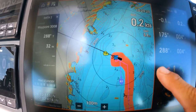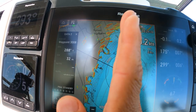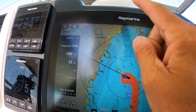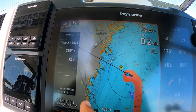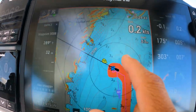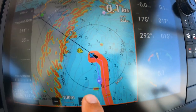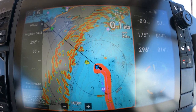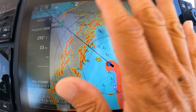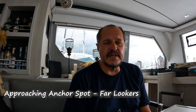When you overlay the radar with the chart, the charts are normally set up with north pointing to the top. You can see the radar now with the shore — the red dots there — that blue boat, the one over there, and the two boats there. So you can have a very good picture by overlaying the radar with the chart.